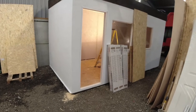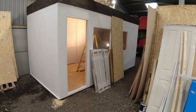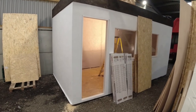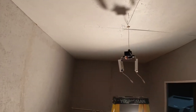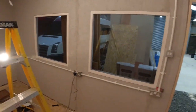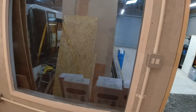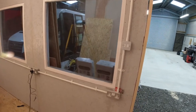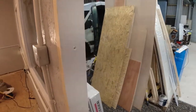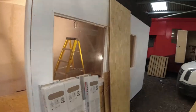This is the office that we built. It's all constructed out of 2x4, 2x3 and OSB board, because it was simple. Needs another coat of paint in here. Going to have some LED lights on the ceiling. The two windows — these frames were built to the size of this glass, not the other way around, because this glass is tinted and it comes out of a partition that goes in call centre offices, or you'll see them in exhibitions. So two bits of glass, recycled — we like to recycle and reuse.